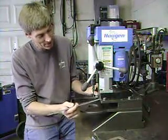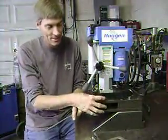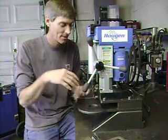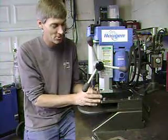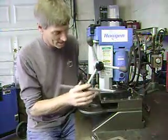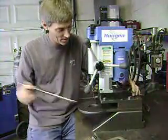You need two stops in the front and two stops in the rear to keep the drill from turning. When I put these pins in the lathe, I put a shim in them so they're a bit eccentric — you can loosen and turn them slightly to gain about seven or eight thousandths of eccentricity on each side, which lets you tighten or loosen the fit so the drill slides in and out. The rear stop is set by when the magnet is flush with the front. If your magnet is shorter or longer, you must make this adjustment.